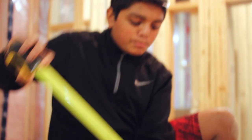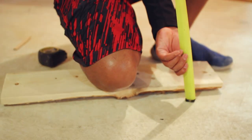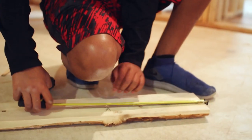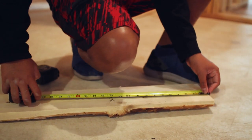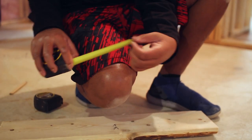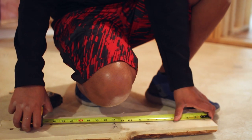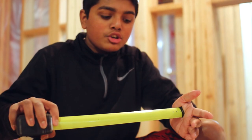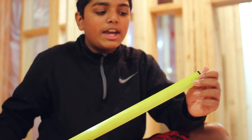So if I pushed and got a measurement of, let's say, 1 foot, and then I needed to cut a piece of wood and I hook it, it'll be the same. But if the tape measure hook was fixed, I would get a 16th off, and it would be maybe too tight or too loose. So the tape measure manufacturer engineers the tape measure to give you the accurate measurement when you push or when you pull, because of the angle of the hook.